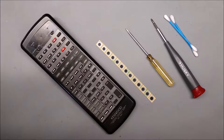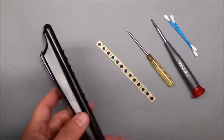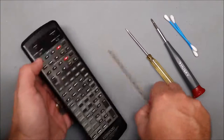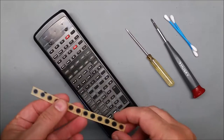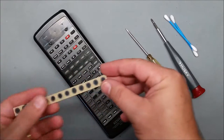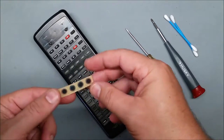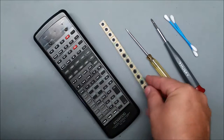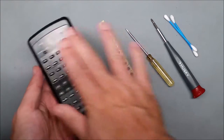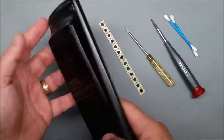Here I'm going to show you how to repair the buttons in the Kenwood RC-140 remote control. I don't have a specific keypad for this one because there are so many buttons and they're all identical. They can be handled with my universal five millimeter — it's a 10 millimeter square with a five millimeter circle conductive dot. All the buttons are just checkerboard right in there.